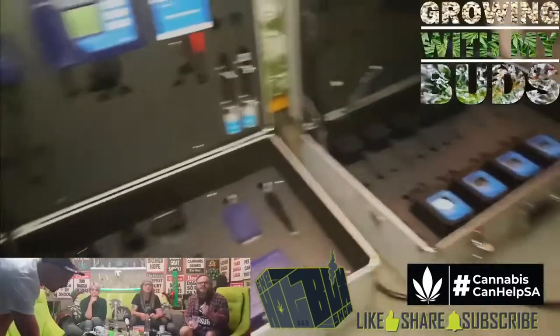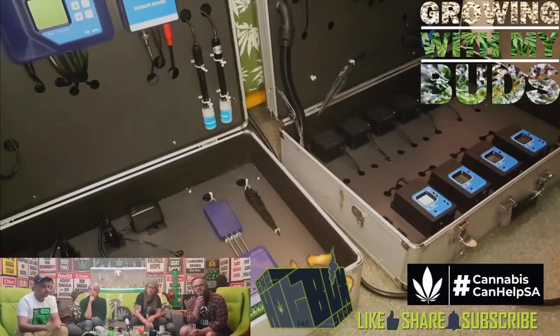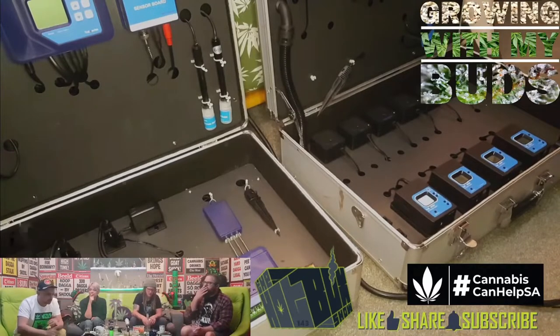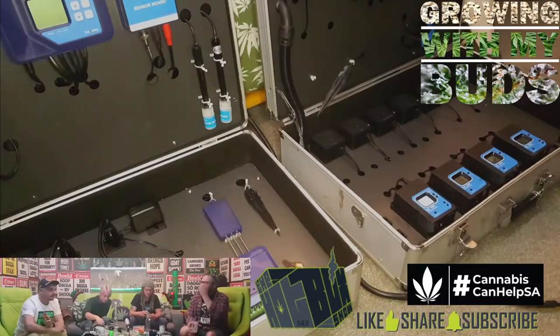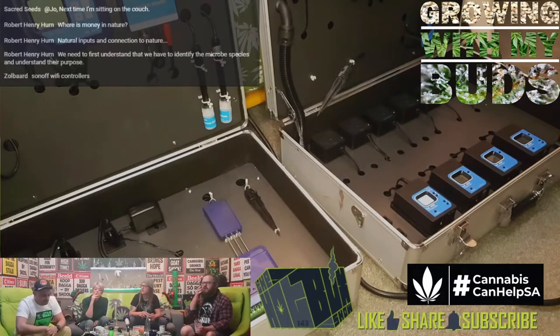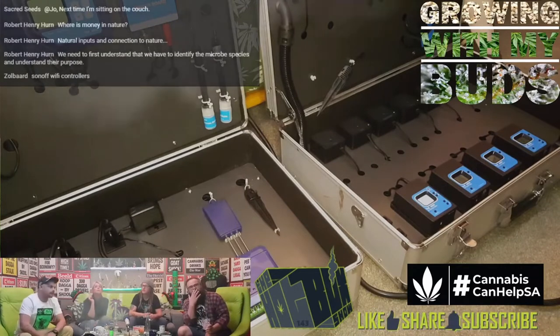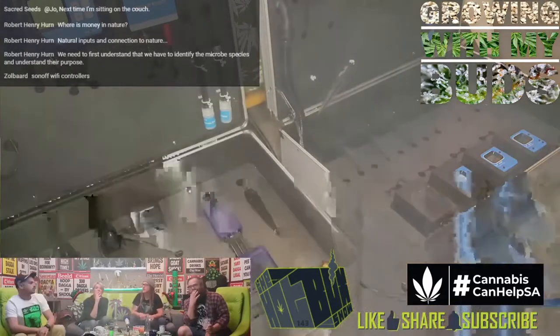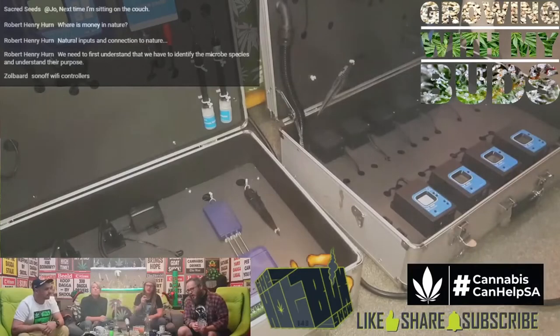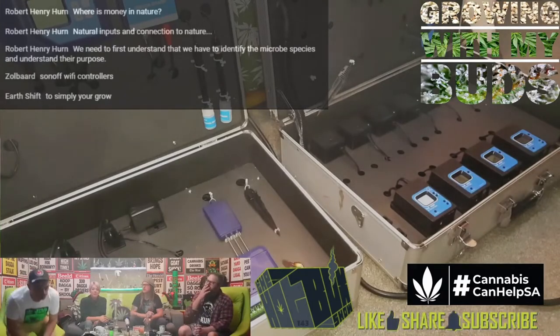So what can you automate? You can automate your lights, your temperature, your humidity, your CO2, your irrigation, your dehumidification, your light intensity, your inflow and outflow of air — pretty much anything that has a switch to turn on and off. A lot of the time we started off with basic automation using simple timers — turning a fan on or off at a certain time — and then progressed to thermostats, which turn a fan on or off at a certain set point.